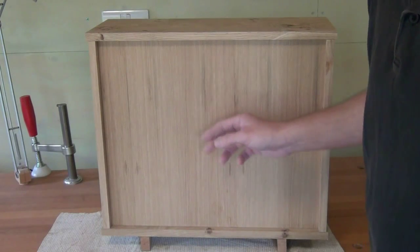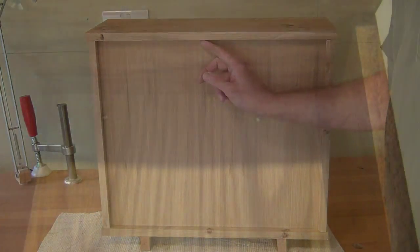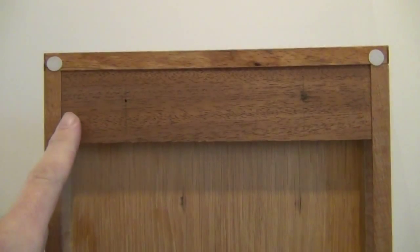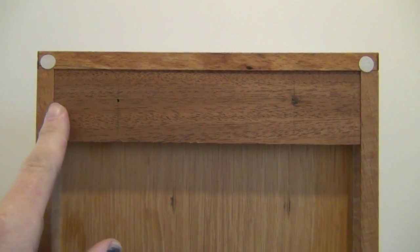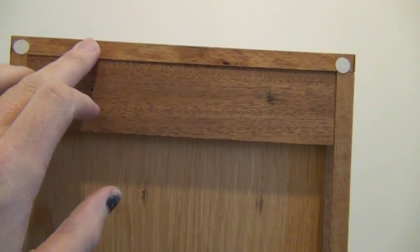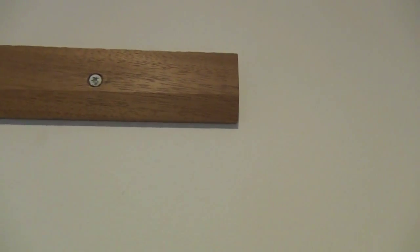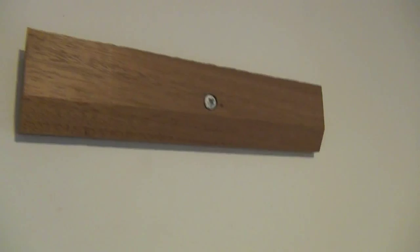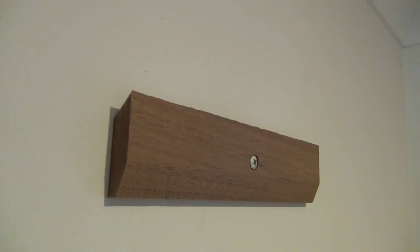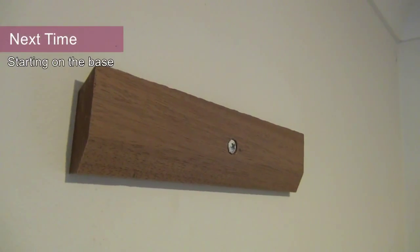Applying the cleat now will allow you to insert a couple of dowels at each side and perhaps one in the middle of the top. An alternative way of fitting a French cleat is to have a couple of screws through the back, but this doesn't allow for fixings into the sides — it's purely holding on the top of the cabinet, both directly and through its connection to the back. The other half of the French cleat is fixed to the wall. The 45 degree angle at the top acts like a hook, and there's a mating surface on the underside of the cleat on the cabinet.